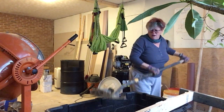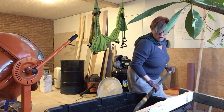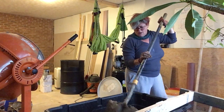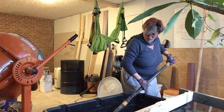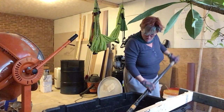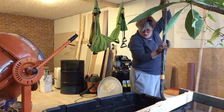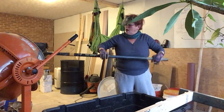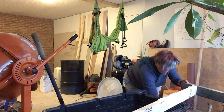Now, what about a water-to-water heating system? So in this case, we have a tank full of water in the stove. And that's how I do my boiler. The reason for that is it's just really simple and really safe, and it offers a really wide range of operation that's safe. It can be a really hot fire, a cold fire. You know, it's really hard to create a dangerous situation. The big tank is open to the atmosphere.